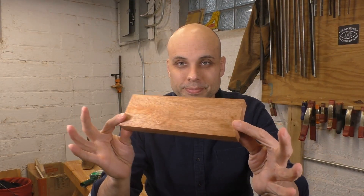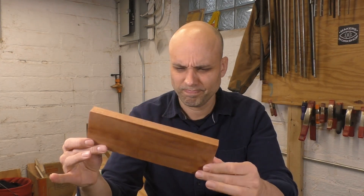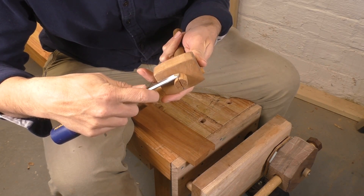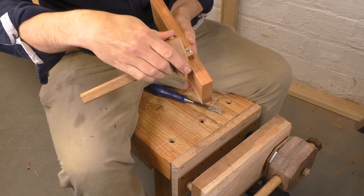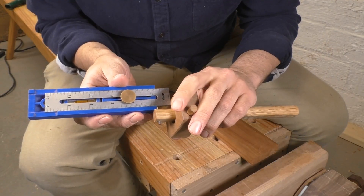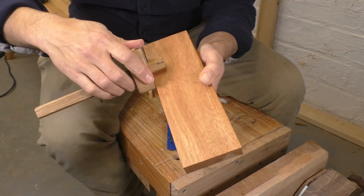And I've already started by prepping this piece of wood. It is dense and it is hard — I honestly have no idea what it is, but it doesn't matter. It was free. I'm going to start by cutting a rabbet to match the width of my three eighths chisel, so I'll set my homemade marking gauge directly to the chisel and strike a line across the bottom of my stock. This rabbet should be around three quarters of an inch wide, and my little Craig measuring jig makes it easy to find my depth and strike that line.